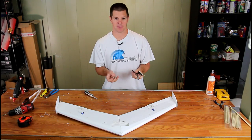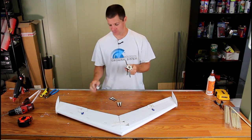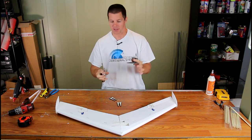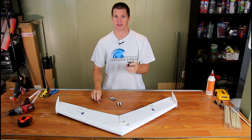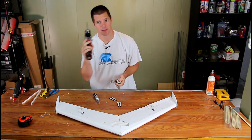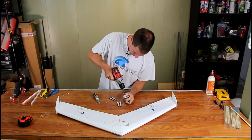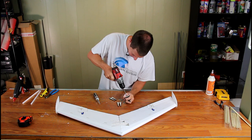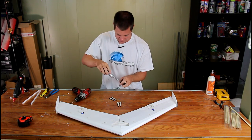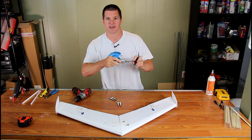The airplane's motor mount is simply made from quarter-inch plywood, laser cut. If you're using the stock motor screws, they're too short to get through quarter inch, so you can use eighth-inch plywood instead. If you do use quarter inch, drill about halfway down through for each screw hole — be careful not to drill all the way through, just enough so the screw sits down inside the motor mount. Then go ahead and tighten it in place.